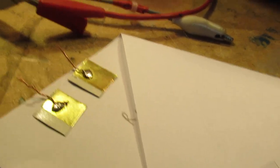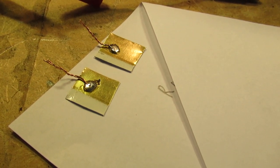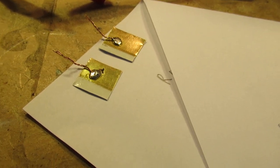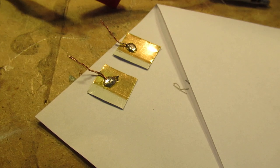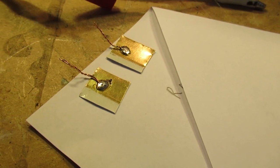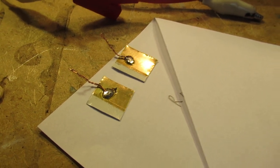And in the past, in old Dutch books, say in books of the 1920s, we find capacitor values not in farad or picofarad, but in centimeter. And 1 centimeter is approximately 1 picofarad. The deviation is approximately, as far as I know, 10%. So 1 picofarad is 0.9 centimeter. Anyway,